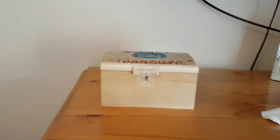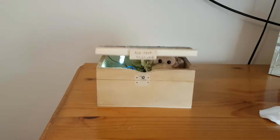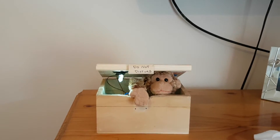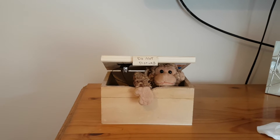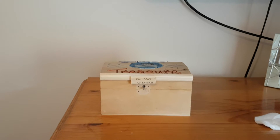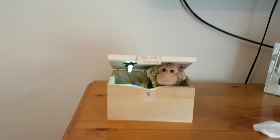Hello again, this is an Arduino controlled useless box. I would highly recommend this project for the beginner. Basically all it consists of is two servos and an LED. The LED is not software driven, it's just from the low side of the switch. Basically all I've got is a series of functions that increment a count on each iteration, and obviously when it's switched on again it moves on to the next function.